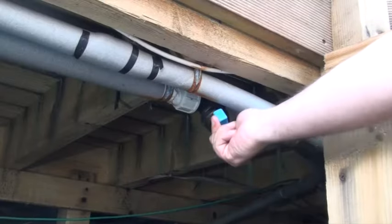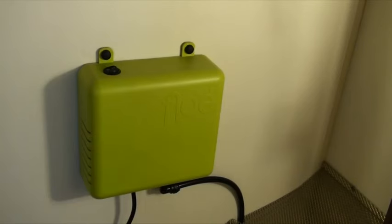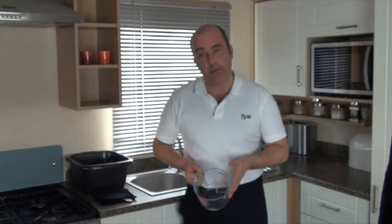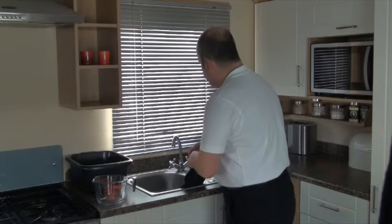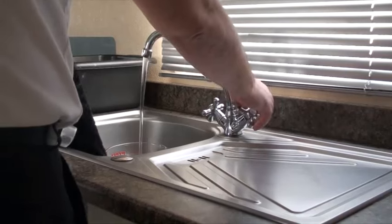We've made sure that the mains water stopcock and all taps or faucets have been turned off, and very importantly that the boiler is unplugged and the toilets have not been flushed — this will make sure that the system is airtight. So it's time to do our first drain down; we'll just switch Flow on. Now that Flow has built up air pressure in the water system, we're ready to drain down our first tap or faucet. Although I'm going to drain the cold tap to begin with, it really doesn't matter which outlet you drain first. So let's drain this first tap — I'm going to lift my jug, put it in here, and we'll start running. I'll cover it with a face cloth because I don't fancy getting it all around me.